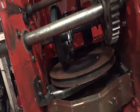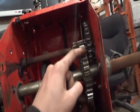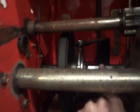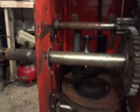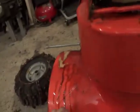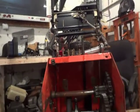Cables look pretty good. Everything works like it should. So I'm going to go ahead, grease up all these gears here, grease up the chain. If you need to, grease up your slider here. This one does not need to be greased up. So you're looking pretty good there. Once this is all done, I'll throw the tires and rims back on, throw the inspection plate cover back on, and then this thing's pretty much done, so we can fire it up and throw some oil into it.